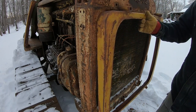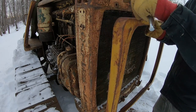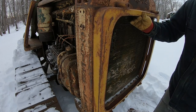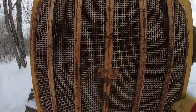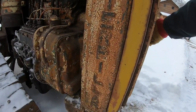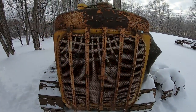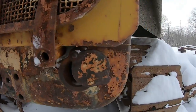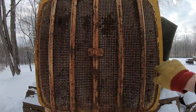For this last part we're going to need to use our imaginations a little bit because I'm not taking that NOS core out of that wood crate. The core has four ears on it that line up with the bolt pattern of the original grill. You would attach the core inside the surround, and the core and surround would bolt up to the front of the radiator, giving you your extra room to slide that oil cooler core in front of the water core. Finally you finish it off by reinstalling the original grill — so you just have a slightly thicker radiator, quite a pronounced bump out there, but you've hidden a lot of extra hardware behind that. Pay special attention to that housing where the starting engine crank goes in — you can see it's a little bit overtaken by that shroud.